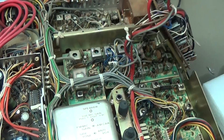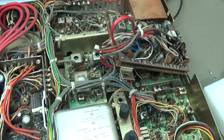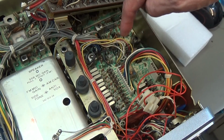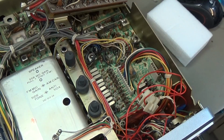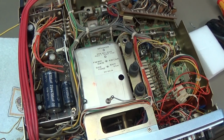But on the other hand, I'm not easily able to get a board like this down here out of the radio for recapping, because I cannot simply take a connector. So here is one connector in the radio, only one, but all the other wires are connected with this wrap technique, and getting all the PCBs out would really mean a lot of work, and then you have to recap it. So I would not really say that this is a job for a repair shop.